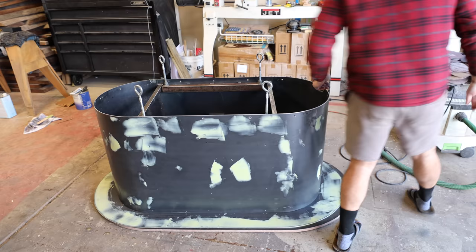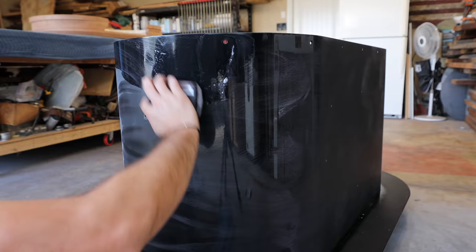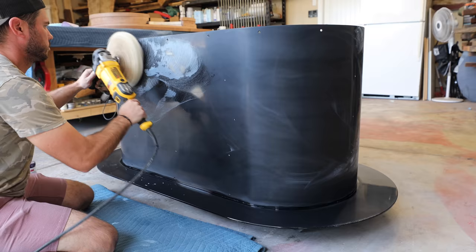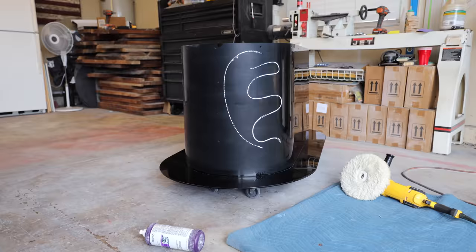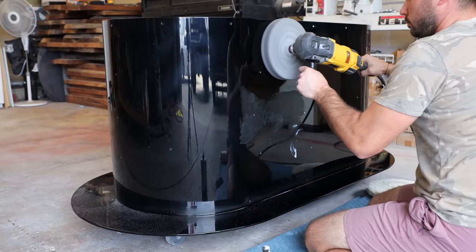I made one last bottom wood plate, edge banded it, stained the top and bottom black, and moved on to the bodywork for the steel base. I started with body filler, block sanding, and then about four or five coats of primer with block sanding in between. It was a full automotive-style paint process with a base coat — black — then a clear coat, then I brought it back and started the wet sanding process to polish it up to a glass-like shine. I've done this process for the last two poker tables as well. This one I got a lot fewer runs than the last one so I didn't have to spend as much time fixing errors, but the polishing process definitely takes a while. I went from about 600 grit all the way up to 5,000 grit to make my polishing life easy.